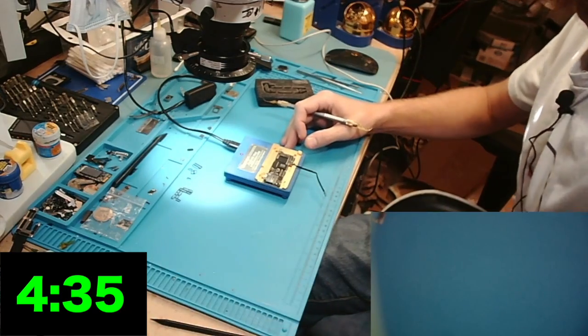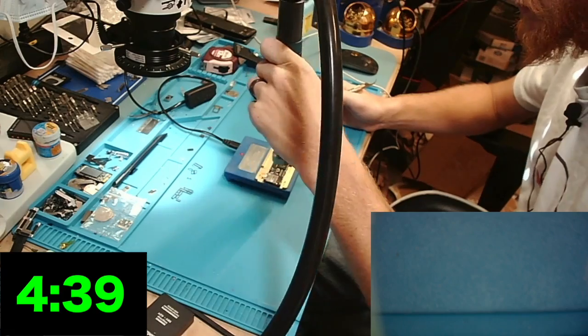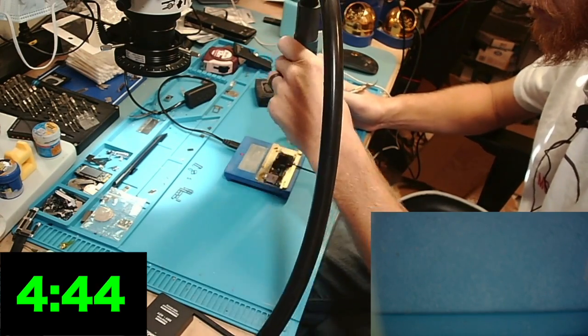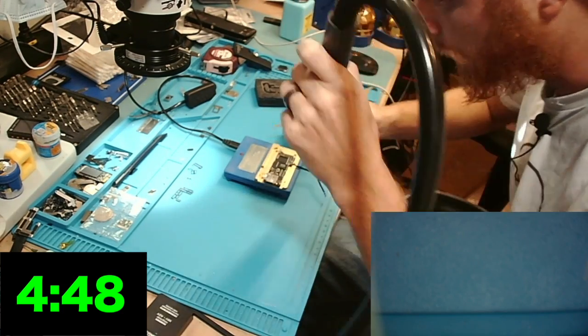All right, about this time, I'm gonna start bringing in my top heat. And again, I'm just going over really quickly the entire top half of the board to get it heated up. And then I'm gonna come in with my pick, see if the board's loose. She's not yet.